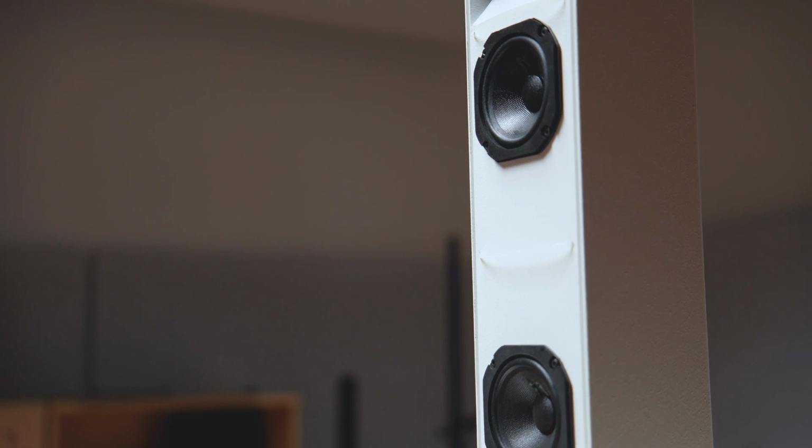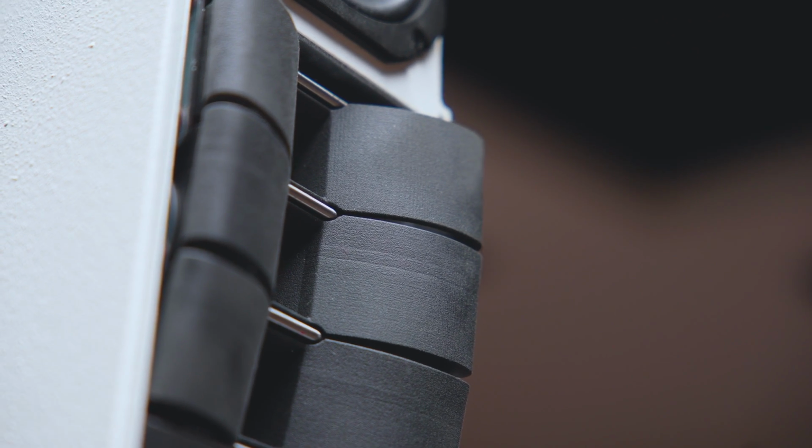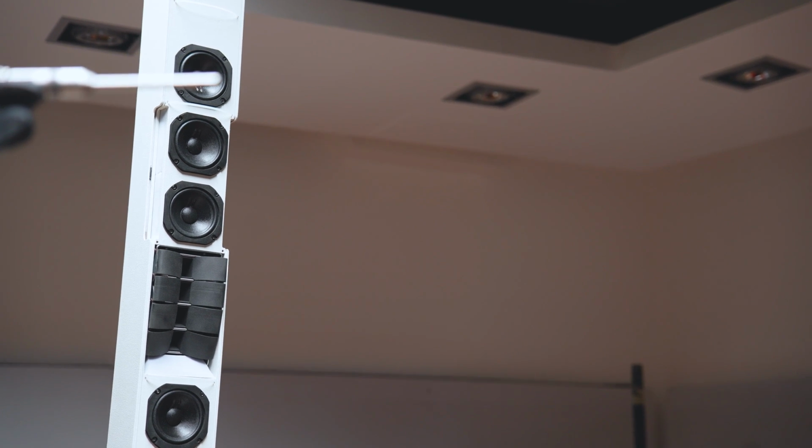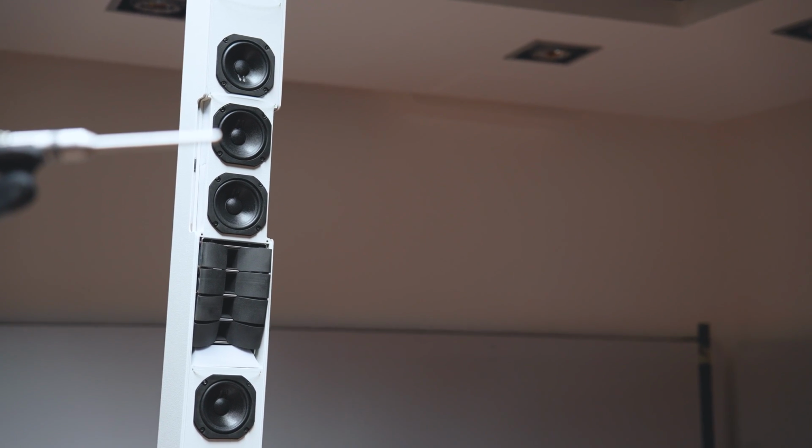The patent-pending part of the speaker is the high-frequency array. Not the kind of high-frequency array is patent-pending, but the mechanism of how to shape it. You have other speakers with arrays in a column speaker, and if you want to change the pattern, they are switching off some high-frequency drivers or filtering them differently, or they are mechanically tilted, but you keep the radiation characteristics of that array. Here we have designed a kind of mechanical curving, which is operated from the back of the speaker, and it curves like in a line array. So you keep the angle of the first upper driver and you curve the lower ones. So you start to spread your energy over the field you want to cover with sound.